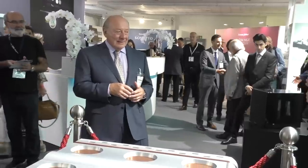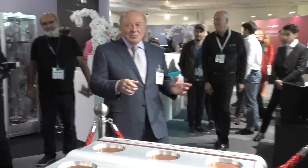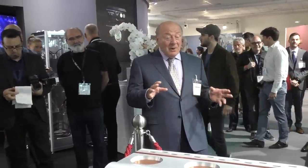So now we have an amplifier that has very low distortion without global feedback, because all of the distortion products are mixed together with the negative and the positive, which are exact reciprocals of each other, and they null out all the distortion products. So this at full power is 0.006. The Momentum is 0.1, which is marvelous. And this amplifier would be 0.12 if it wasn't a perfect balanced amplifier. We do not have global feedback, so there's no way to change that. So that's what we get just by adding the two sections together. We also get incredible signal-to-noise ratio and incredible dynamic range.